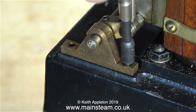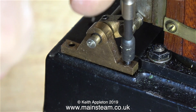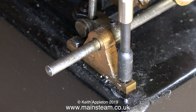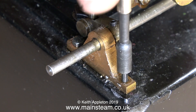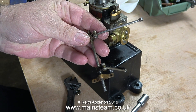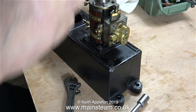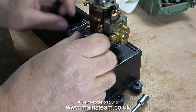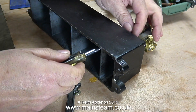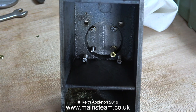This socket is slightly bigger than it needs to be, which is useful because I can move it at an angle and it makes it easier to withdraw the bolt. Here's the same thing at the other side — first one bolt, then I lean the socket slightly to remove the second one. Here is the valve linkage from the engine, about to be put into the green box with all the other components. Now I can remove the cylinder — it was a bit stubborn though. I could use a socket on part of it, and on the other part I had to use a screwdriver.